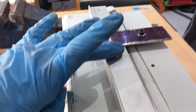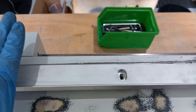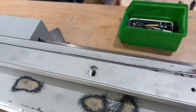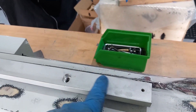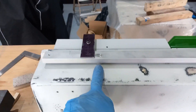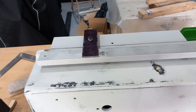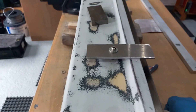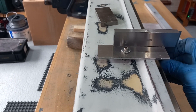All square, and the only thing I've got to think about now is that this end is 0.4 of a millimetre lower than this end. I'm not too worried about that - it's square, that's the most important thing. It's absolutely square to the carriage. I just bolted that on. Moving the carriage up, I've got a 0.4mm gap. I will probably leave that because it would be too difficult to try and raise it and keep it square, so I will bond that in position and just use a little shim under it to bring it up.